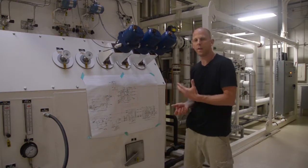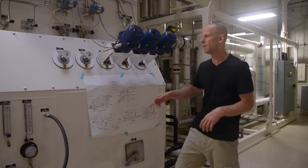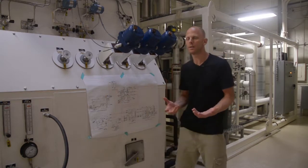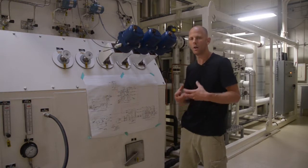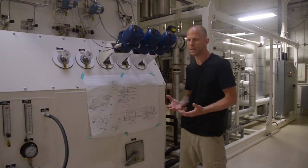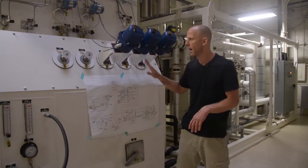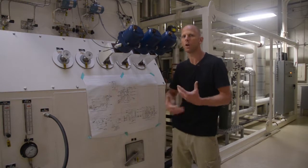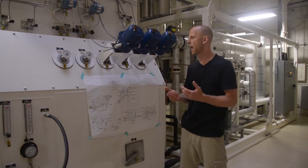Obviously, if you have got lots of air going to the column and you are pulling out lots of nitrogen product in nitrogen mode, if your nitrogen product valve is wide open, at some point you're going to begin to lose purity because you are taking too much nitrogen out of the plant. So in nitrogen mode, if you are battling to find a good purity, you can do two things. You can increase the air to the column, and you can reduce the draw of nitrogen product, keep more nitrogen molecules within the distillation process, and therefore allow your purity to come back up.